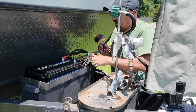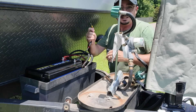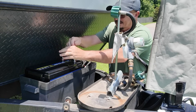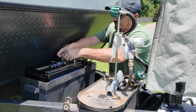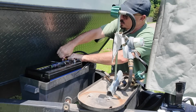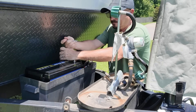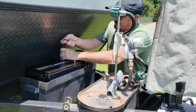Oh, what did I forget to hook up — one of the positive leads! That's the positive lead that feeds the radios inside, so we definitely don't want to leave that one out. I probably need to stop talking and actually do more work before I forget to hook up something critical. It wouldn't have taken me long to figure it out when I got inside and didn't have any power for my radios. Anyway, that's just a little bit larger than the two batteries it replaced, still fits in my box, but gives me 50% more capacity — I just think that's phenomenal.